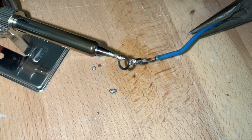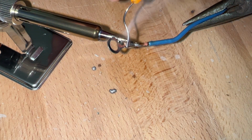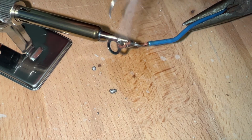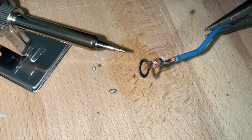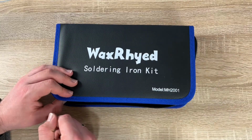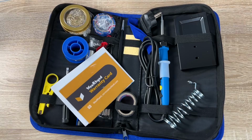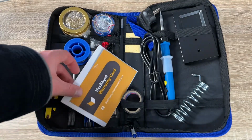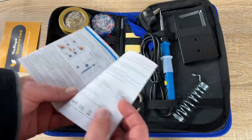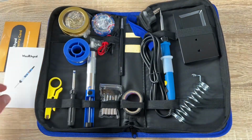As the solder melts, it will flow into the gaps it needs to fill. Continue to feed solder until a sufficient amount is melted. While we need enough to form a solid connection, we don't want to have too much solder either. The right amount will vary from project to project. This typically won't take more than a few seconds.